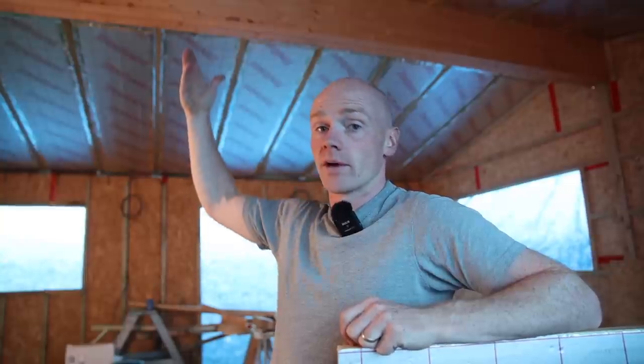Now this design of roof is called a cold roof. So if you're looking into a project for yourself, whether it's an extension or a garage conversion or something like that, there's two different types - well, there's also a hybrid roof, but we won't go down that messy hole. A cold roof, which is what this is, means that your timbers are essentially cold, because the structure of the roof goes all the way up to the top and you've got an airflow above. Your insulation usually is just between or under, like in a lot of traditional loft spaces, where you've got your insulation lower down and you've got that cold roof space.